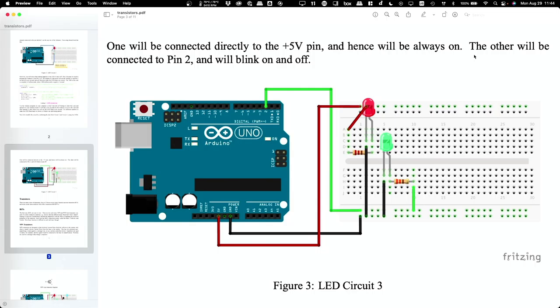So now you need the four things that are at the far right. So the LED, another resistor, and two wires. Okay, and then you've got to upload the program to the board. When you copied and pasted, I think it probably screwed up the... Yeah, it was bad. I had to backspace everything. Yeah, because the language that this is written in is extremely picky about spacing.